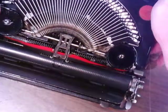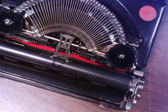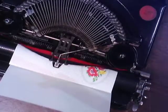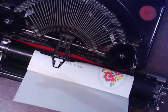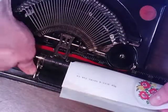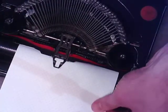She types great. Now it's got the new draw band and enough winds and good feed rollers and all that stuff. Let's just jam up some keys here — quick brown fox... I'm running out of line room here. That works out great. And those replacement feed rollers — I actually went to some clear tubing; it changed from that red stuff. I went to clear anyway. But that's a nice font.